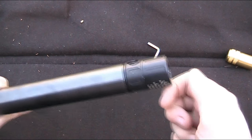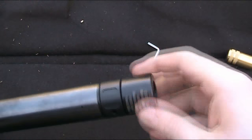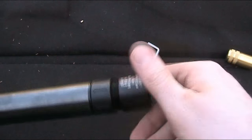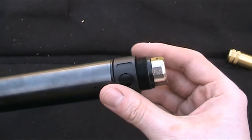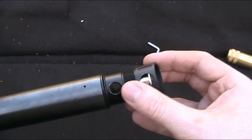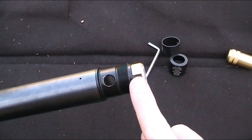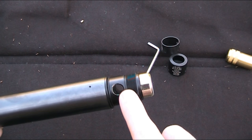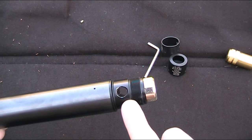With all the air out I can start to dismantle the cylinder. First of all you need to unscrew this black metal protecting cap from the end of the cylinder around the gauge, and then with that off you can remove this protective cover for the filling port. The next thing is to remove this entire gauge assembly, but it is very tight and very difficult to unscrew, so I'm going to have to move to the workshop to take that off.